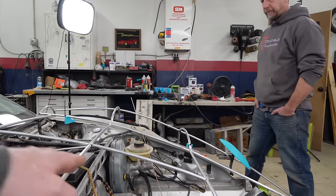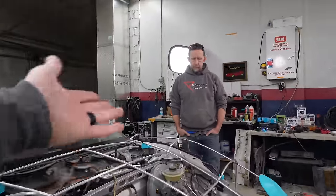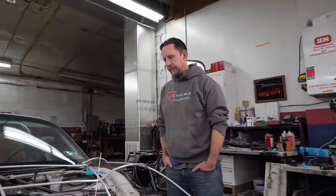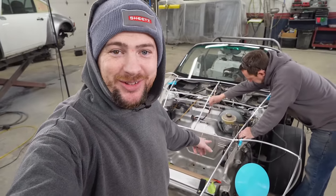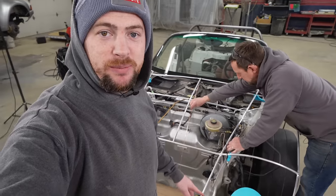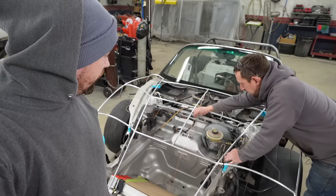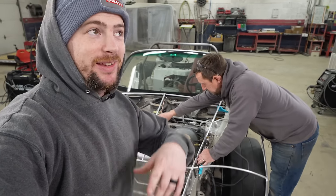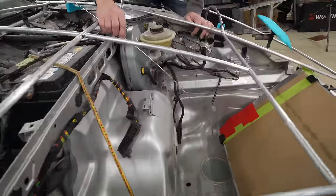It changes the entirety of the radius in the back side. I think we don't move it - we already have a chassis that's already built and already functions. We didn't build a tube chassis from scratch like other race builders would do, and we're not building a race car race car, so I vote we don't move it. Our current idea is to take wire and make another wireframe for the duct work that goes behind the radiator for the air to exhaust out through the clamshell, so we can use that as our guide for some poster board and then turn that into aluminum.